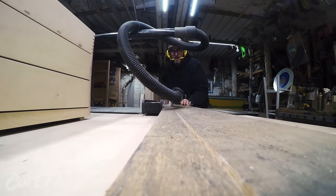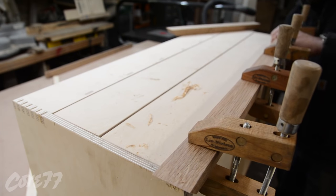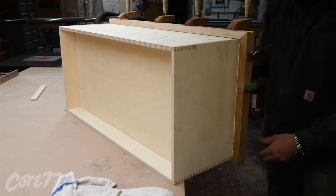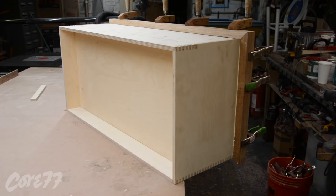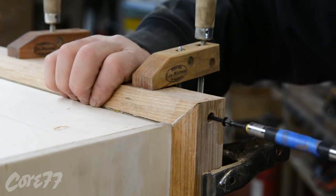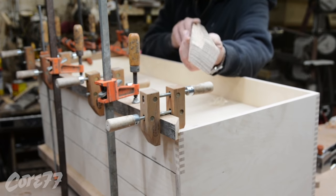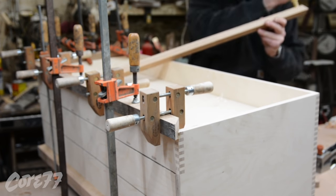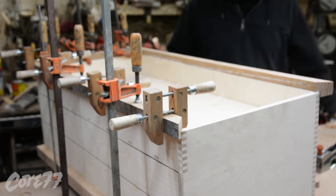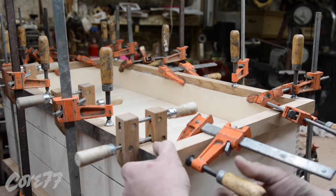Now I have a piece of one-and-a-quarter-inch white oak. I'm making the bumpers for the bottom. I use the chop saw to cut the bevels. Everything is glued in place, but once the glue dries I put screws in everything, and then I cap it with a plug made from the same wood. For the top, I have a rabbet in the top bumper so that it glues from two sides, right onto the corner. I'll put screws in the corners of each one of these as well, so there's a lot of glue surface area.